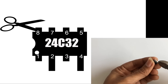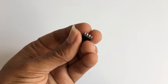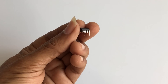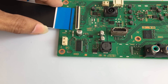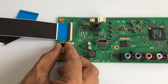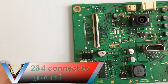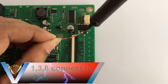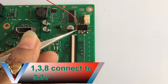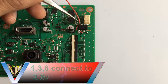Here, access the 2nd and 4th pins — cut and sharpen the remaining pins to size. Let's fix these 2nd and 4th pins on the ground of the main board. Connect the 1st, 3rd, and 8th pins to VCC 3.3 volt.